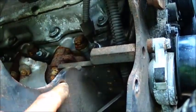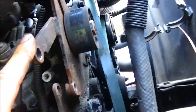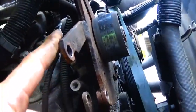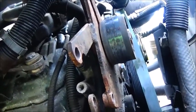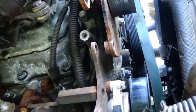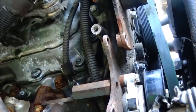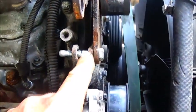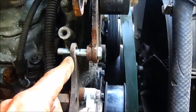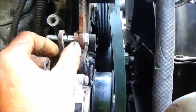We're gonna try to get some kind of a flat between here and this back bracket. We'll chop this off — this is just an extra that came down for the AC compressor — and probably just get the plasma cutter out here and a fire extinguisher of course. I measured between here and we got 550 thousandths.